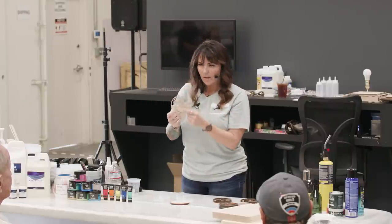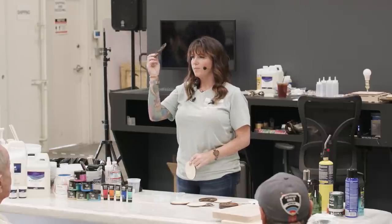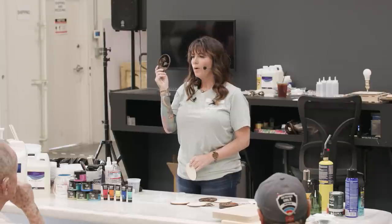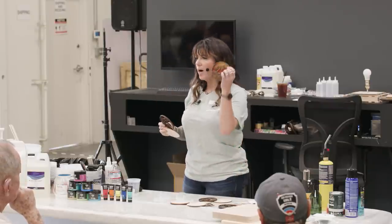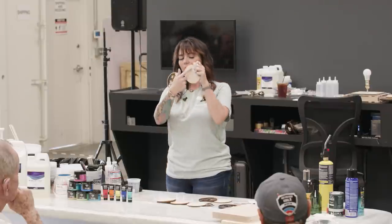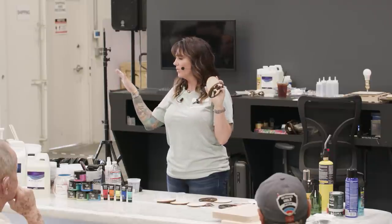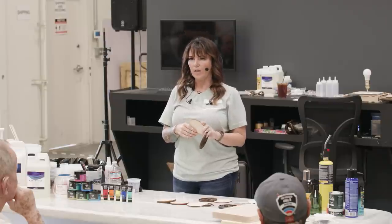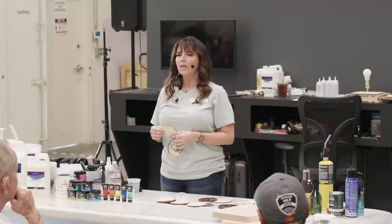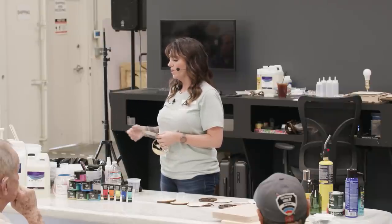From there you seal your first two pieces — this is important when you are working with epoxy. If I add any color to this epoxy, it is going to seep into that wood and you will get a lot of streaks through every bit of grain. When you apply varnish it just bleeds out and goes everywhere — epoxy is terrible at that. This is probably in my top 10 of 'oh goodness, Jess, what happened, how do I fix it' questions.